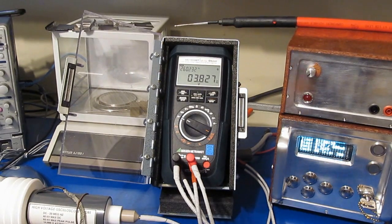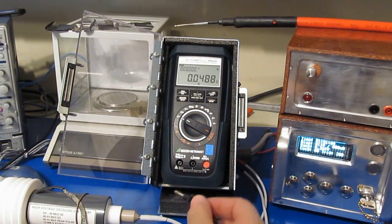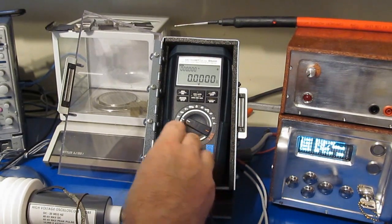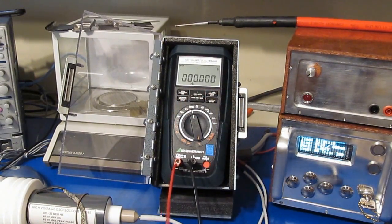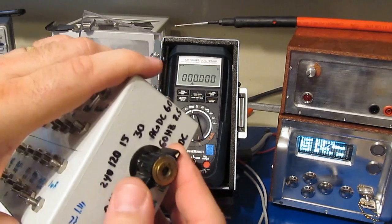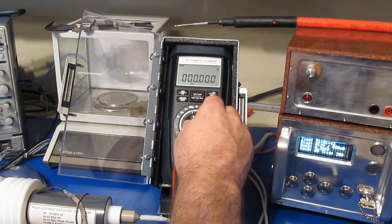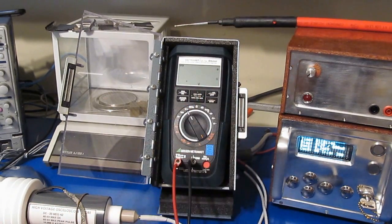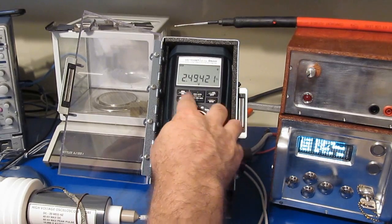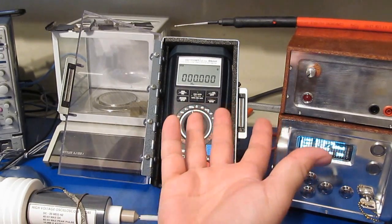We'll go ahead and functionally test it, but before I do that I want to show you another problem I've noticed with this meter off and on. Hopefully it will replicate this time. It has to do with the frequency input. I'm attaching this to our small test box - currently set for 60 hertz with a two and a half volt output. This is switching between five volts and ground. You can see that here it's two and a half volts at the center point. I rotate it back - still reads zero.